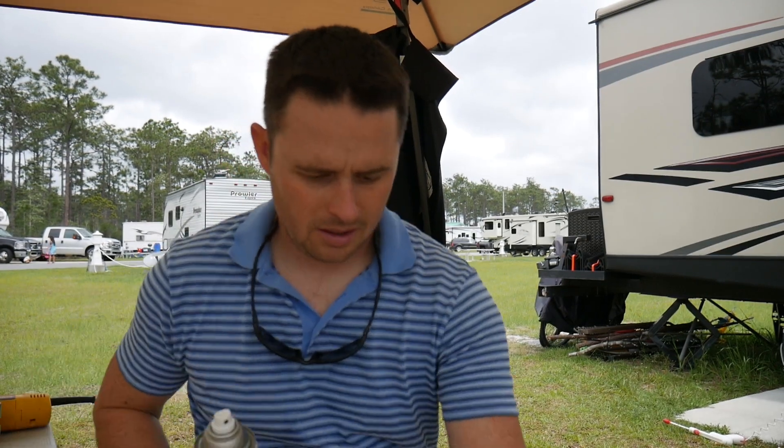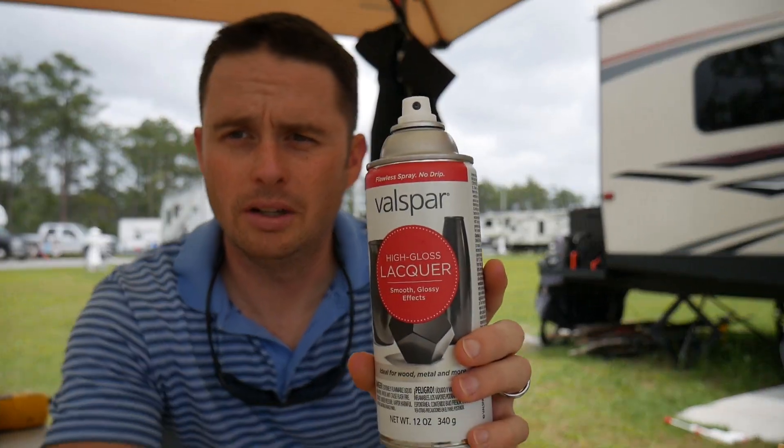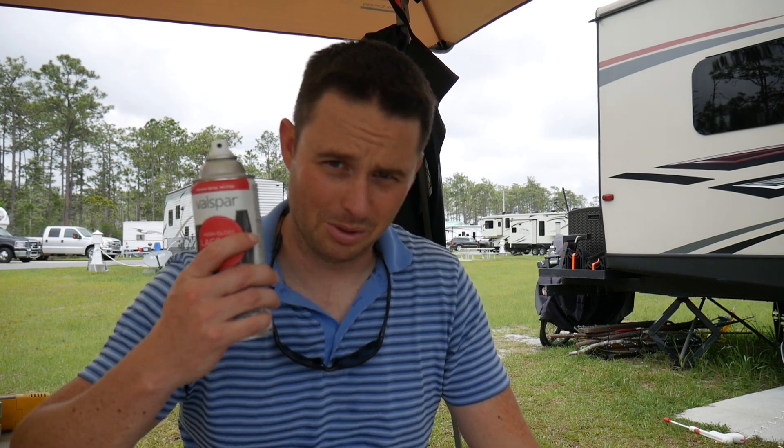We have cut out all the templates and now we're going to hit this with some high-gloss lacquer. This is going to give us one extra coat of protection in case we get water or moisture into the van — probably from the kids spilling a drink. We also plan on using silicone to caulk the edges and some expanded foam to fill gaps. I didn't get marine grade wood, just standard pine. I think marine grade plywood is way overkill, and I don't like the gases and chemicals that come with it, so I'm going to spray my own and control exactly how little I put on.